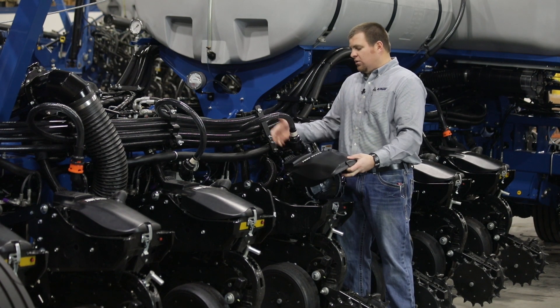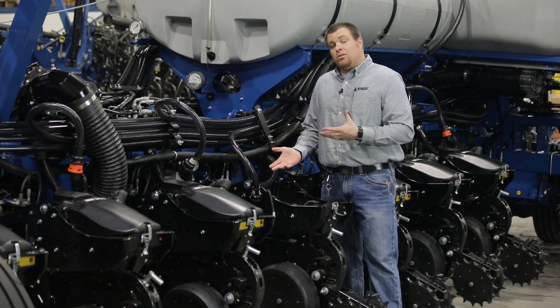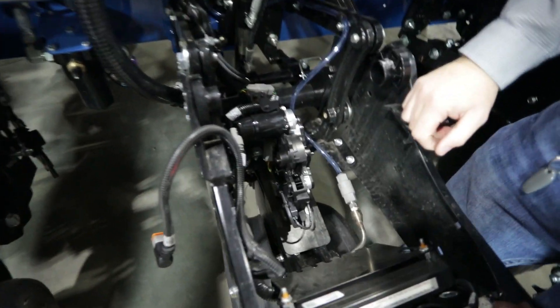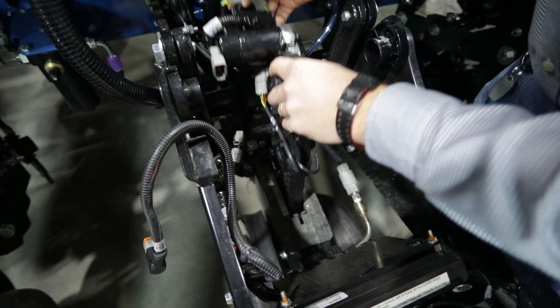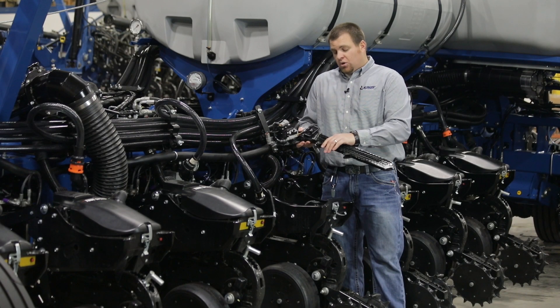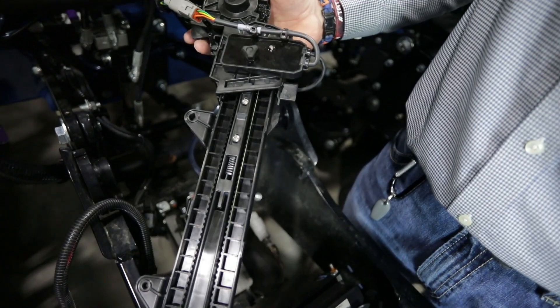With our swivel bulk fill hose, it's easy to take off — just do a quarter turn and take our bulk fill hose off. Sticking with one electrical connection for our meter, we get into our delivery tube and one simple delivery tube connection, and then the whole delivery rail and delivery tube comes out as one assembly. The nice part about anything on the delivery tube is it's tool-less removal. For example, if we want to inspect our delivery belt on the inside, we simply use one tab, slide down, and we can disassemble our delivery tube.